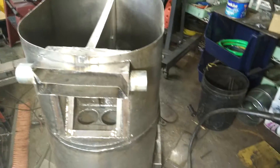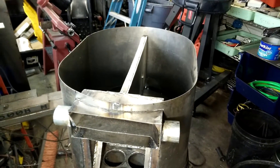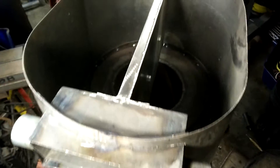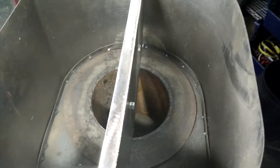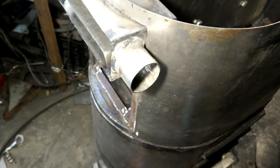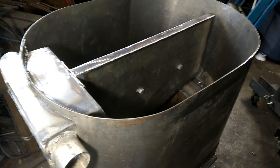Of course, there's connecting hardware like the lid is there but I don't have any sort of a hinge for it or a latch. There's going to be a rounded lip around the edge of the hopper. Those things aside, this is complete — you could think of it as a gasifier kit, a bunch of pieces that need to be assembled. They're just dry-fit right now; there's going to be a lot of sealant. This plank is attached by a row of bolts and some silicone, and the same thing for the hopper — it has to be bolted all the way around the edges because of this gap here. That's all going to happen once I've water-tested everything.